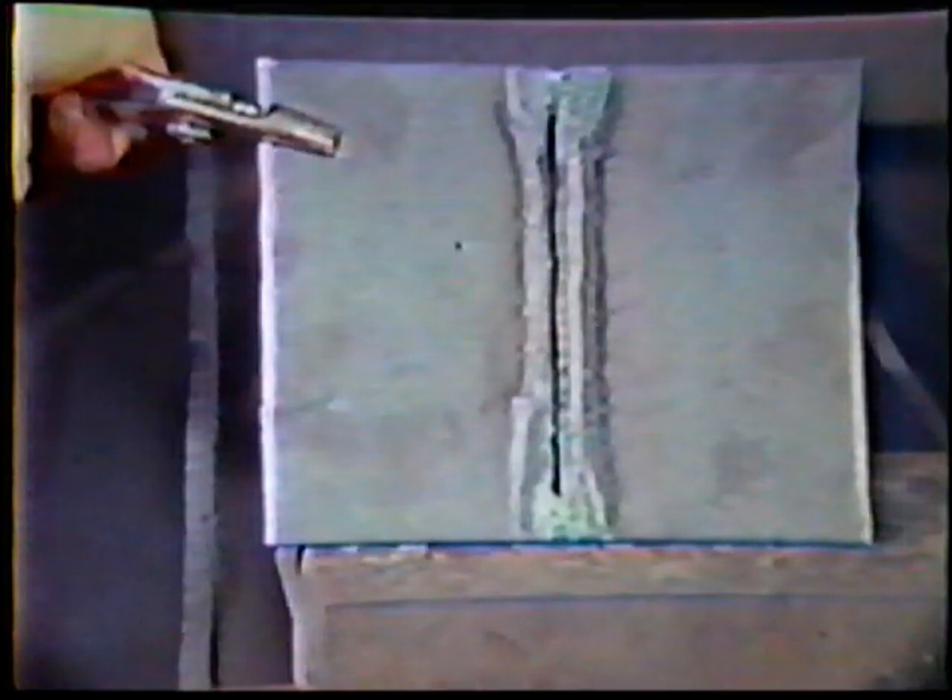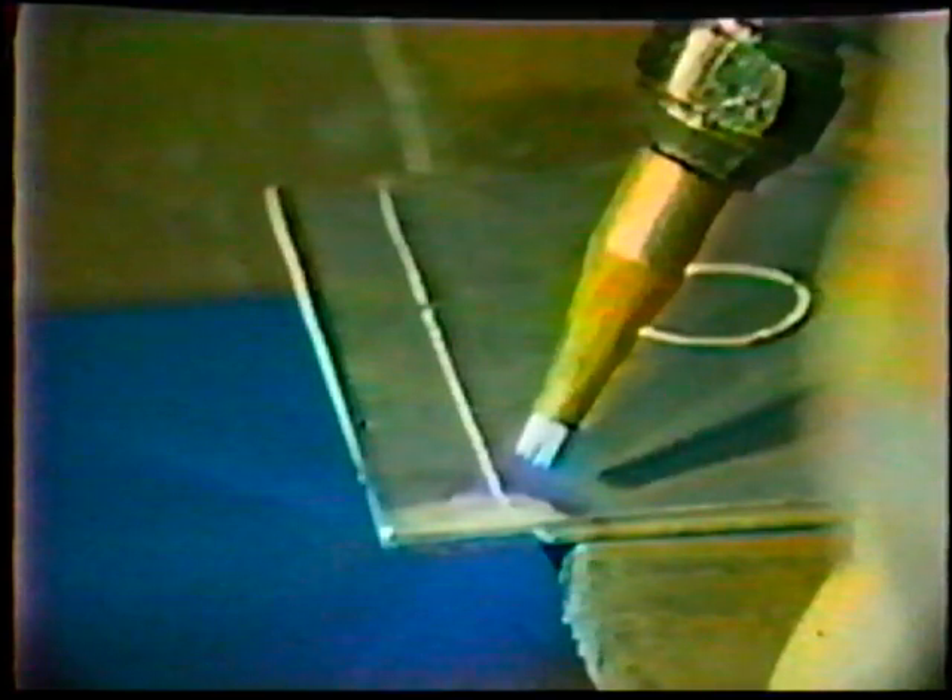The bevel cut is used for producing groove joints. Position yourself over the other edge of the workpiece. Use a 60-degree work angle, which will produce a 30-degree bevel, and a 10-degree push travel angle. The procedure is the same as for the square groove cut, except that your travel speed will be slower because the face of the cut is wider. The finished bevel cut should be smooth and have a consistent 30-degree angle.